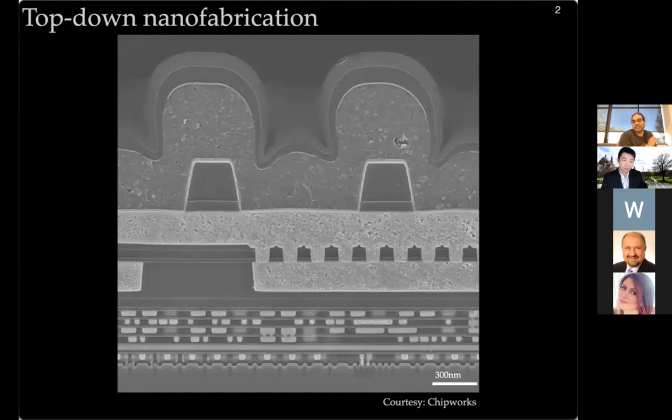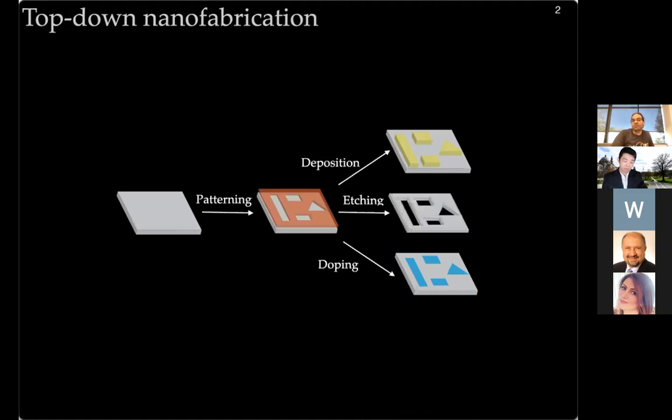What I am more interested in is the fact that once you construct something on a surface and you know where it is, you can register multiple other structures with respect to that particular feature. In this particular chip, about 200 to 400 different layers, 200 to 400 different processes were done, with patterns made with respect to features that were defined on the surface. So you have something on a surface and you're building a whole bunch of other stuff around it. Once you know where something is located with respect to that feature, you can do extraordinarily highly controlled fabrication.